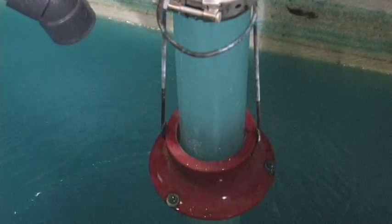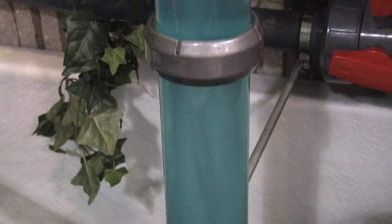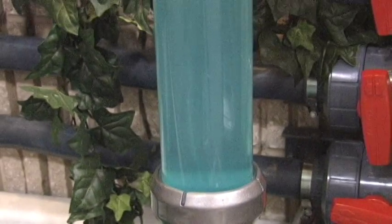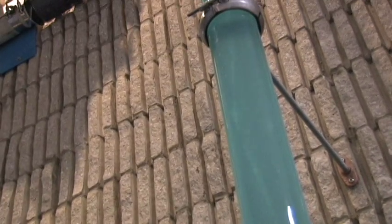It handles the air, goes back into a prime, and the vortex comes right back. You can see that vortex working its way all the way up the suction line into the pump casing.